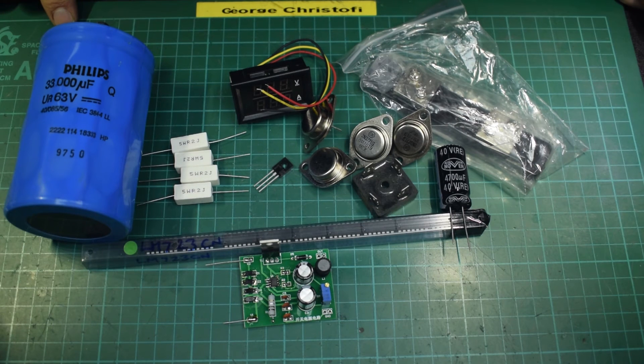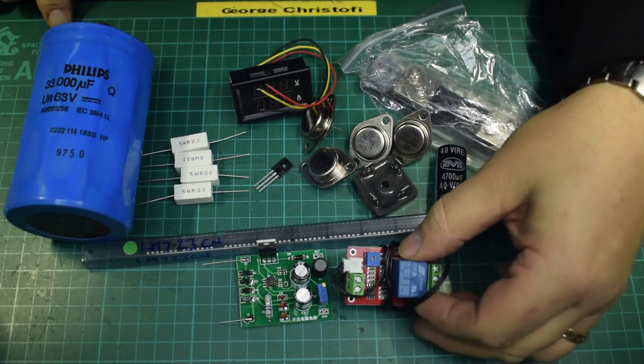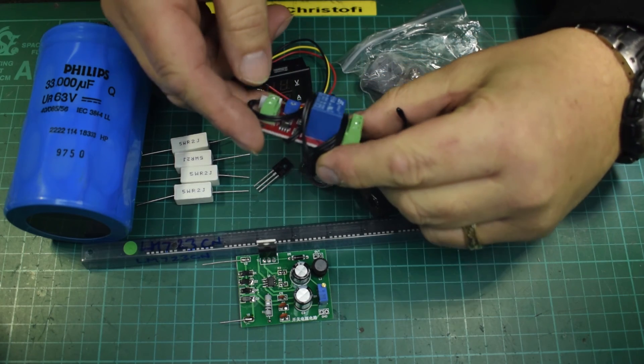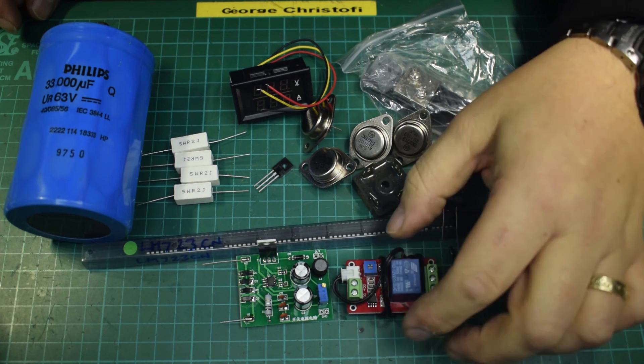It's going to need some cooling, so I'll need some form of fan on it. I'll probably put my large 120mm fans on the back of the heat sink. Rather than have it run constant, let's throw in a temperature control relay board — why not. That way we can stick the thermistor onto the heat sink, supply it with DC from this board, so that the relay does the actual switching based on the temperature setting.